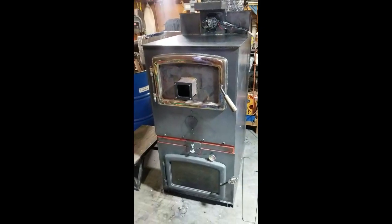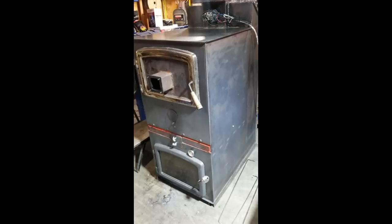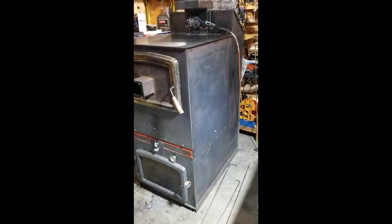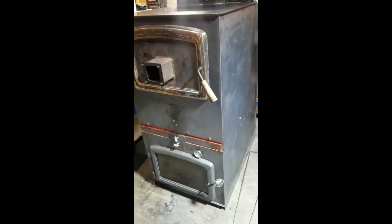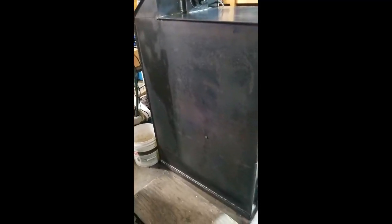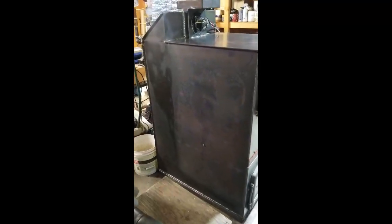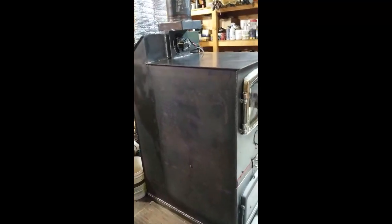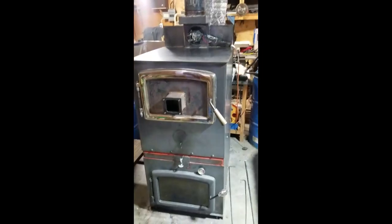I just wanted to get this thing up and running. It took me a month and a half to build, just scratching my head a lot, figuring out how I wanted to do it. The welding was quite intricate — you have to weld perfectly, it's like pressure welding, you can't have a single air leak or you'll have water leaks from the corners. All the seams inside, outside, and around the edges were all pre-tested: I spray soapy water on it, blast it with air from the backside, and check for bubbles. I had quite a few small pinholes to patch up. When you're doing a four-foot long weld your eyes start to go crossed. All in all the welding was a lot of fun. I did buy a new welder for this project — only $400, a 220-volt MIG/TIG/arc combination unit, and it worked phenomenally.